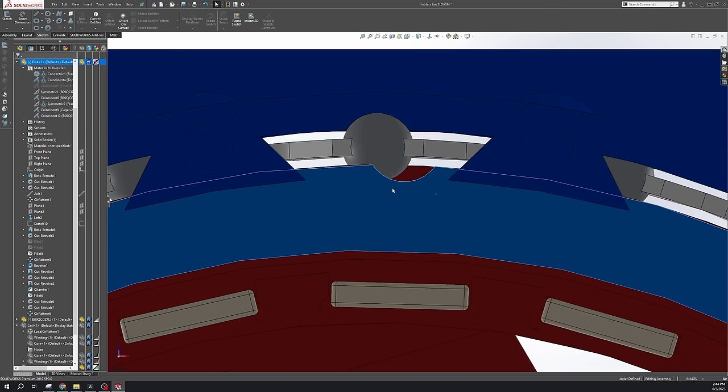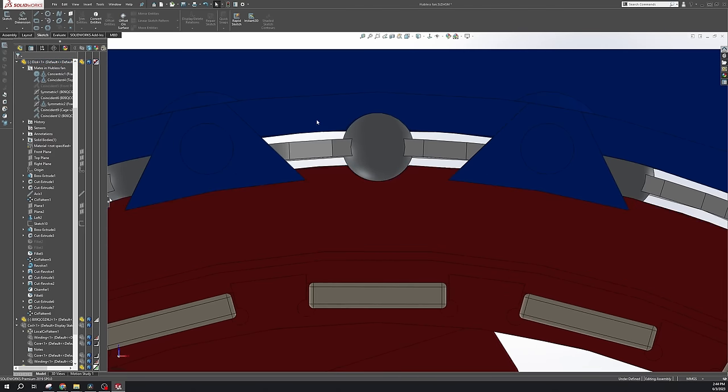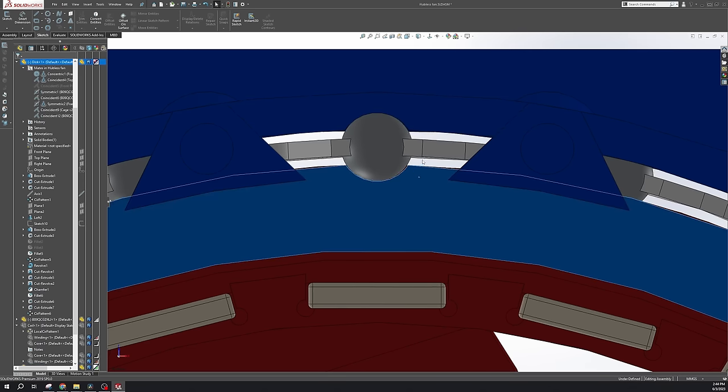And then on each raceway, I left a tiny little cutout that when aligned was just larger than a 4mm ball bearing. And if I had those two aligned and had the cage underneath it, I could press fit each ball bearing into the raceway. And this worked really, really well.